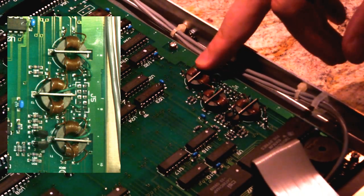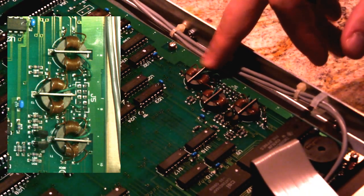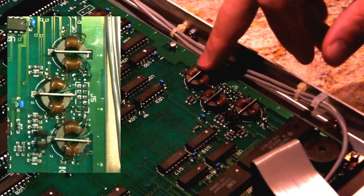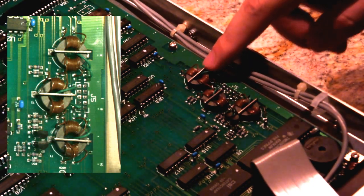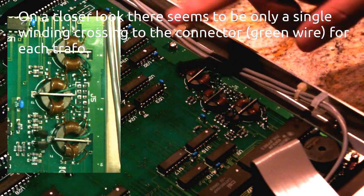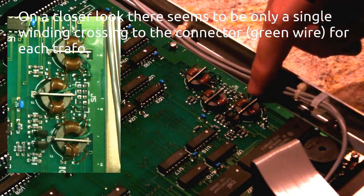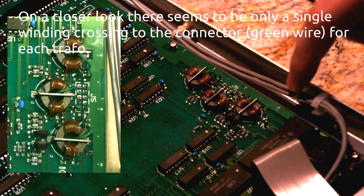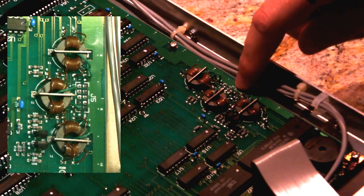I'm wondering, actually, this is probably the isolation. Yeah, I don't see any optocouplers on here, and while they might be on the analog board, I'm going to guess that they're using these as one-to-ones. They definitely look like one-to-one signal transformers for a serial bus coming from J5 here, which probably goes through to the other board on the other side, which obviously has the analog circuitry.